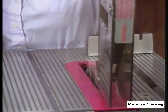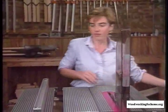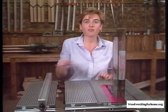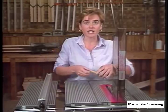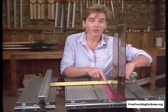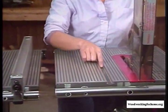Always be sure you're conscious of where your hands are in relation to the blade. This is obviously the blade. This unit right here is called a miter gauge, and it's used for cross-cutting — we won't be using it right now. This piece right here is called a ripping fence, and it can be slid in and out to cut varying widths from very narrow to fairly wide. As an example, we set it for 14 inches. The way we do that is we measure from the fence over to the inside of the blade — you see that at 14 — and then we check it at the front and the back using one of these miter gauge slots as a reference point.